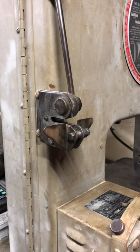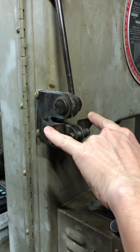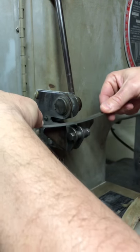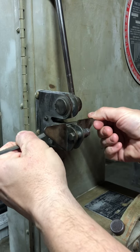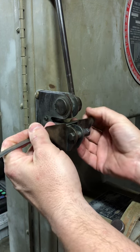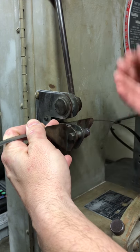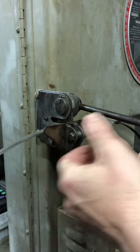So obviously the first thing I have to do is cut the blade, and this part of the saw is the blade cutter, and these wings help you line the blade against the back so that you make a straight cut. So you put this in here and you pull it back against these wings, and it can't move until you get it. You pull it back against these wings until it's nice and flush, you know, straight. And then you cut.